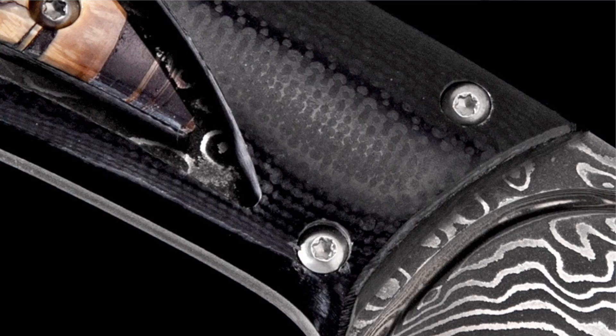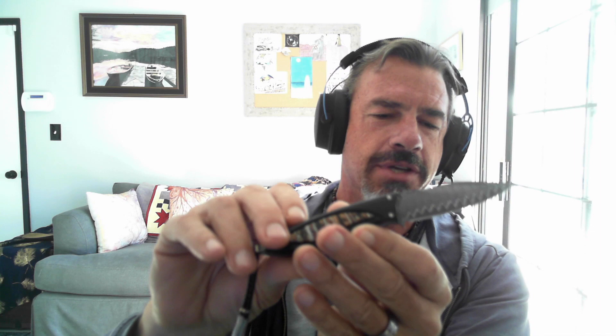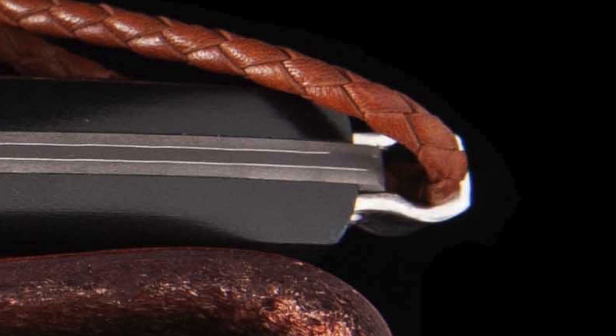I wanted to talk a bit about the construction. The entire blade — the tang, all of it — is Damascus, and those 67 layers show on the edge. I decided to use an all-screw construction: five threaded spacers run inside the handle, and then the G-10 and the tooth screw onto those spacers. That allows us to fully polish the blade to a mirror finish, put the handles on in our shop, completely shape those handles so everything is seamless and perfect — you can't feel any seam, it's just really nice in the hand. Then we take it all back apart, clean it up, etch the blade, and when we put it back together the entire blade is beautifully etched but the seams are invisible. If you just pinned it or glued it, you wouldn't be able to take it apart and get that beautiful etched Damascus finish everywhere without any seams.